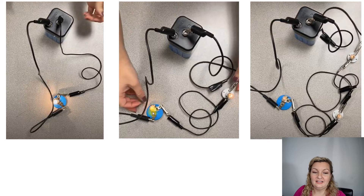As we add another light bulb in — so now we have two — we're increasing that resistance, decreasing our current, and our voltage is staying the same at six volts, so essentially it's sharing that voltage. If we add another one, we're increasing resistance a little bit more and decreasing current a little bit more, while voltage still stays at six volts. You can see a pretty dramatic difference in the brightness of one light bulb versus three lit in series.